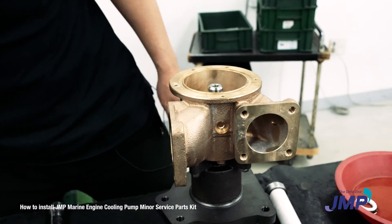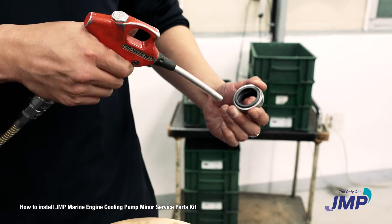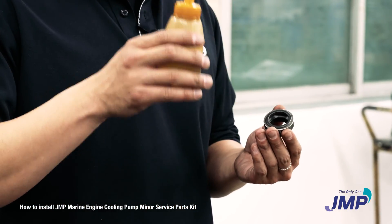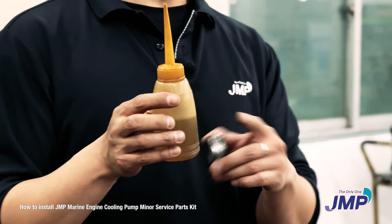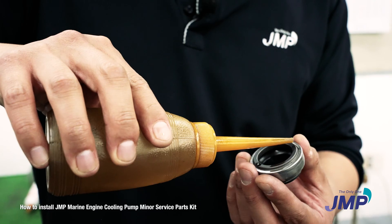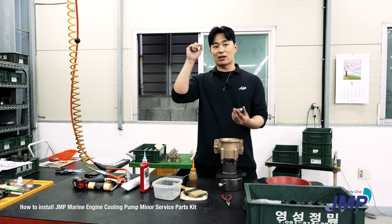Here is the carbon part of the mechanical seal, and we need oil for lubricant. For the first operation of the pump it would be in a dry position, so we use machining oil as lubricant. We are just worrying about the friction between the ceramic and carbon surface.